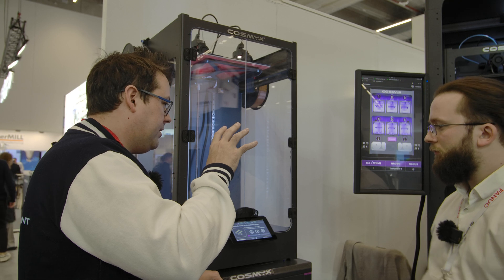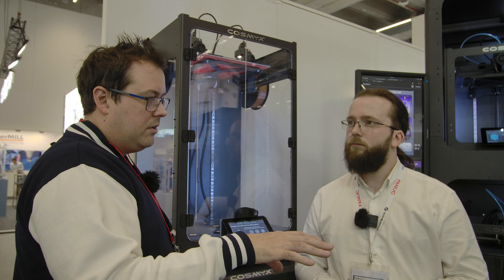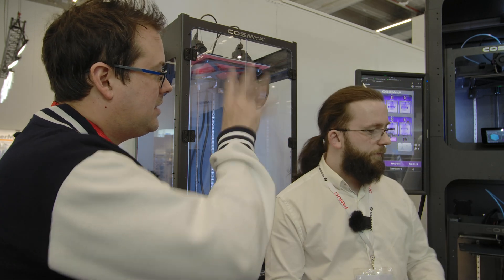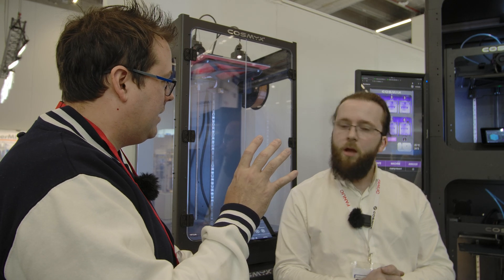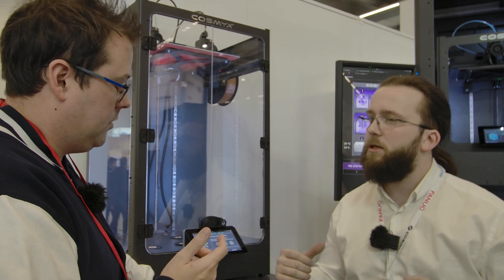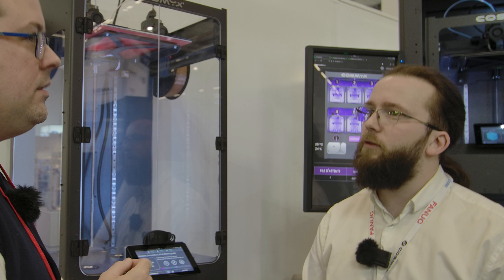When we're dealing at a farm level with the arm currently removing prints — how does filament change work? For the moment we use 10-kilogram spools on special dryers behind the machines. We are working with partners to develop auto loading and auto feeding of filament. But for now, we prefer having 80 kilograms of filament across two dryers behind the machines to be able to print continuously.